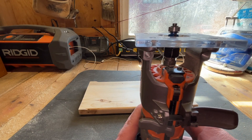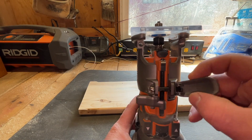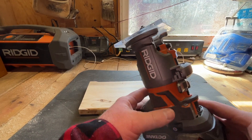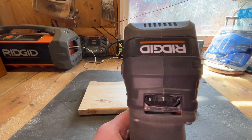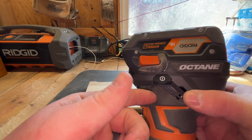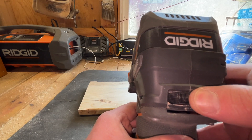For your depth, once you get it to where you want it you can just lower it — that's a good amount. Then of course this is your lock again, so that's the up and down feature. It's also good to note the speed adjustment on the front here. Depending on what you're using for your project and what kind of wood you're using, you can adjust your speed. You just turn it on and the speed goes from seven right down to one.